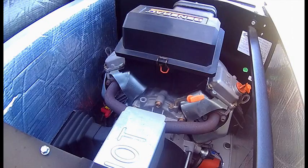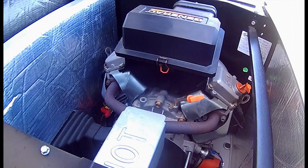And if you're planning to power your home with a portable generator like we did for a long time, you probably don't want to go smaller than 7,000 watts, and get an inverter type. Go the extra expense, because you're kind of short once you drop below 30 amps on the two phases. You're shortfalling yourself. You've got a big shortfall on the amount of power, and you kind of limit yourself to what you can run at the time.